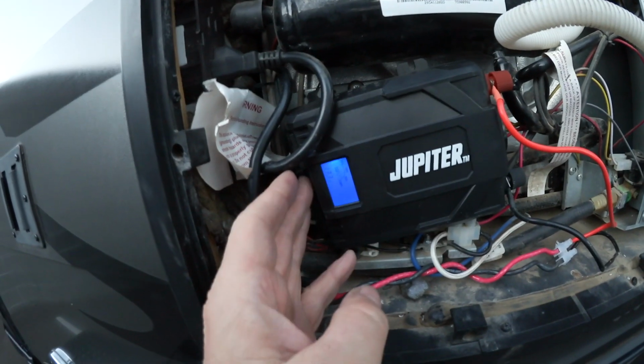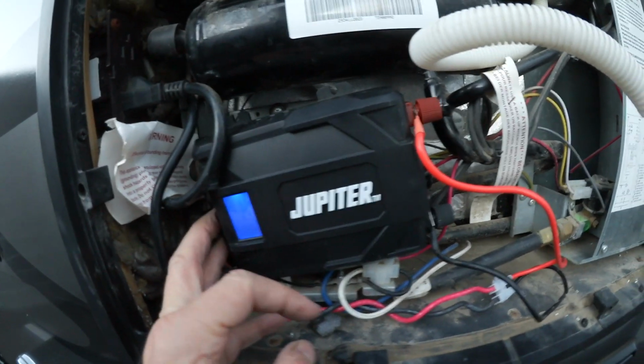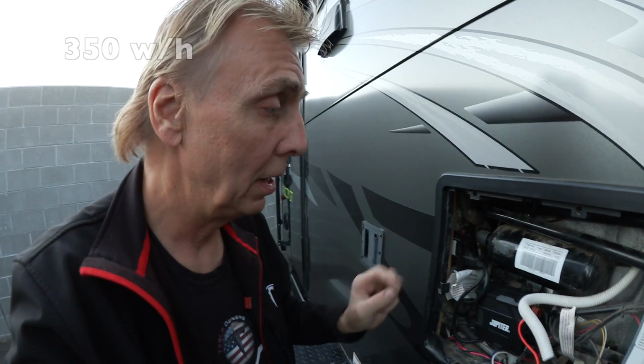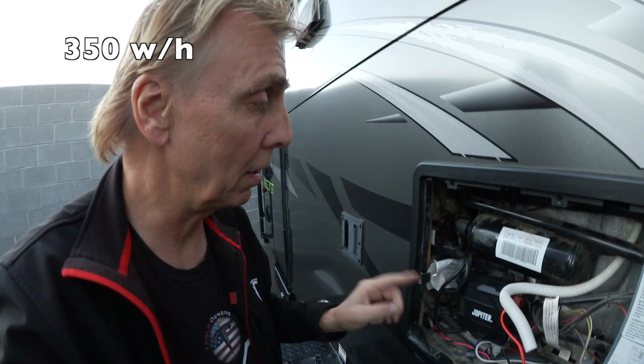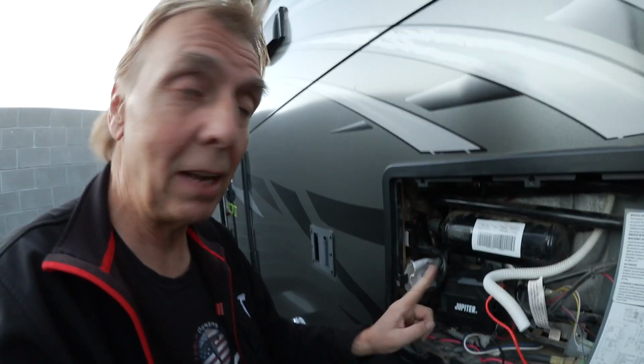and that inverter you can power on here, and you can see 13.3 volt, and if I turn on the refrigerator, then it pulls electricity. I measured it, I can show you a picture for that later. I measured the electricity for one day, how much it consumes. It basically consumes 350 watt. That's quite a lot for a refrigerator. So I bought a 400 watt inverter. Peak is 800 watt.